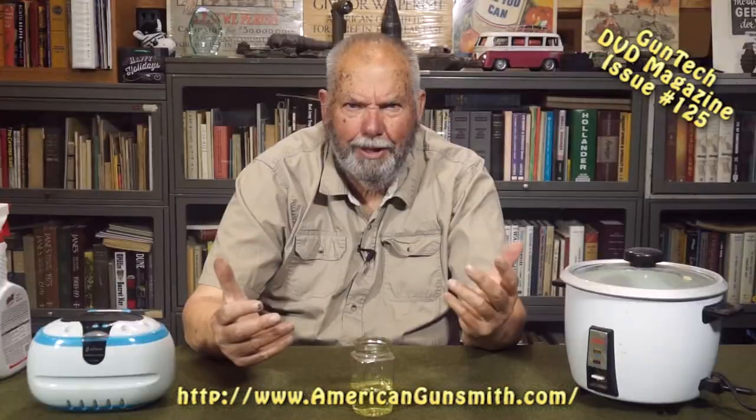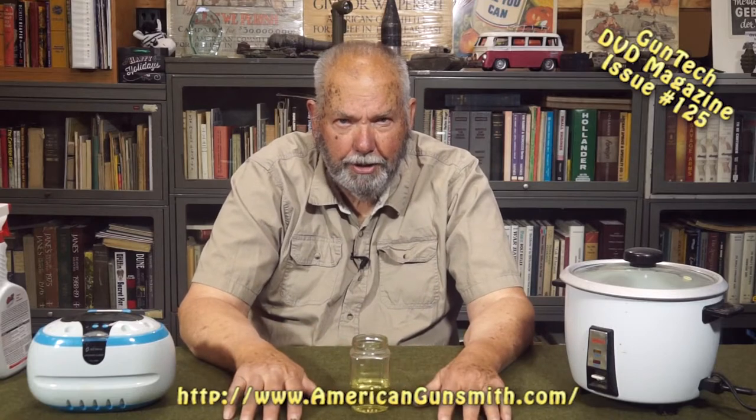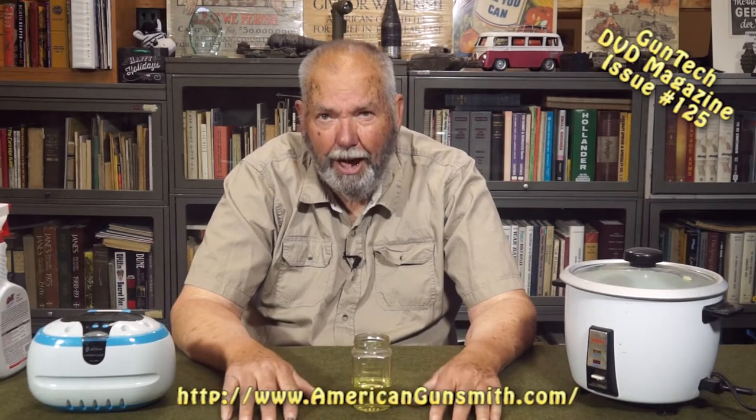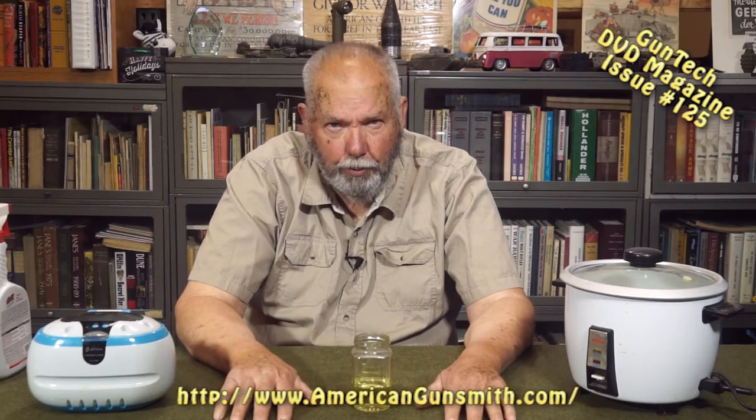We use spindle oil. The name tells you it's oil for spindles — rotating things like mills, lathes, stuff like that. It has no additives like cutting oils, which have sulfur and other stuff. It's got a high flash point, which makes it safer to use. Smells nice — it's a nice oil. You might think it looks like 3-in-1 oil, or ladies, that looks like Singer sewing machine oil — and you'd be right. Only when you buy it in a five-gallon bucket, it's not expensive. It's reasonably priced oil.